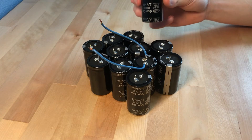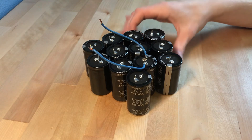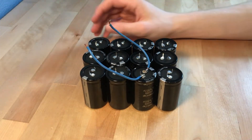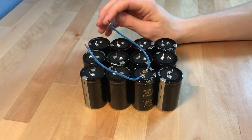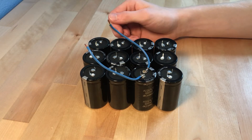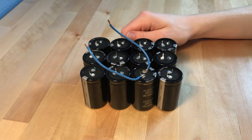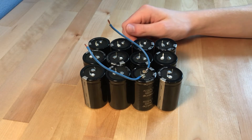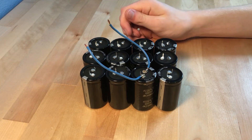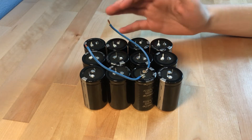Each one of these is rated for 2.7 volts, but I'm going to play it a little safe and just go up to two and a half volts. So with all 12 of these that's a total voltage of 30. If I were going to do this the proper way I would introduce a charging circuit to ensure each one maintains exactly two and a half volts, but I tend to do things my own way, so I'm going to skip the charging circuit and just see if I can charge them all simultaneously — which is definitely a bad idea. But first I need a frame to hold everything together.